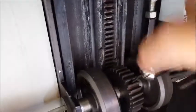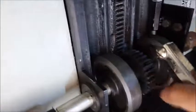So you got to get it up in here, and that's the second. They have opposing Allen's 5/64. Remember that, 5/64, not a roll pin like that one, and that one, and that one. Sorry, watching my hand. Alright, so I'm going to lock it in, slot roll it in and out, check the slides.